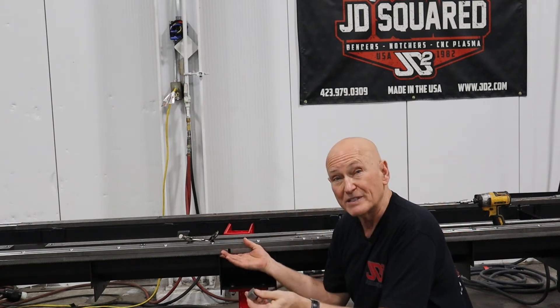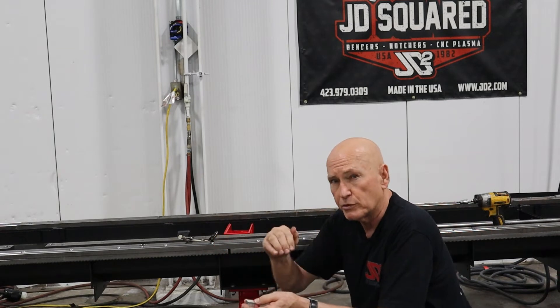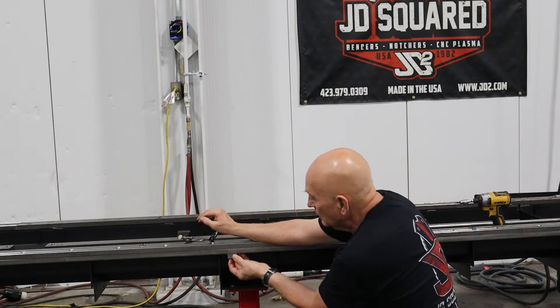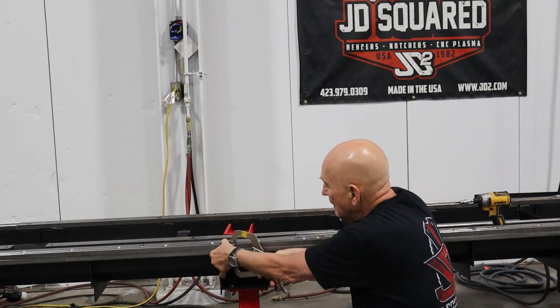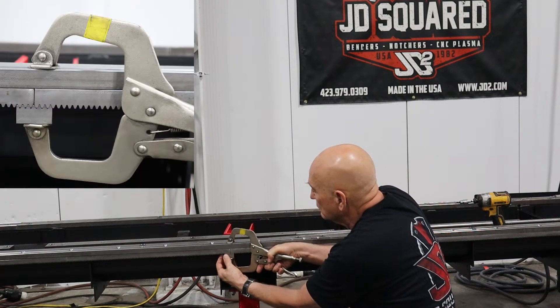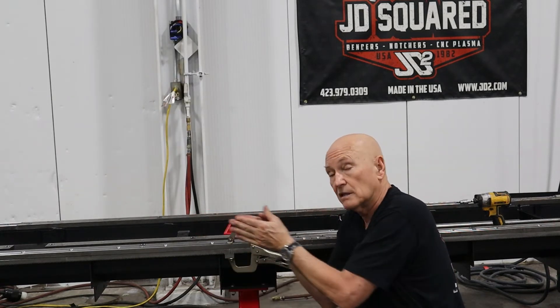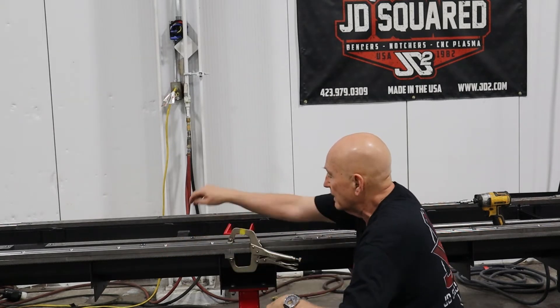Now that all the gear racks are installed, we can adjust for the gear mesh. The idea is to use that short segment to help align the gears. There's quite a bit of travel — a pretty long slot — so we're going to pull the racks toward each other, place the little gear segment right on them, and then using a pair of vice grips pull it down. That's it — we've adjusted the mesh. We don't have to worry about alignment because the dowel pins push back against the gear rack to keep everything lined up.